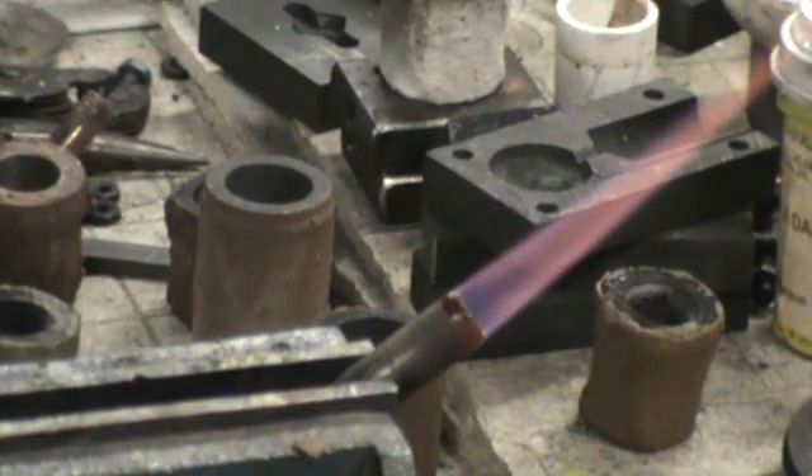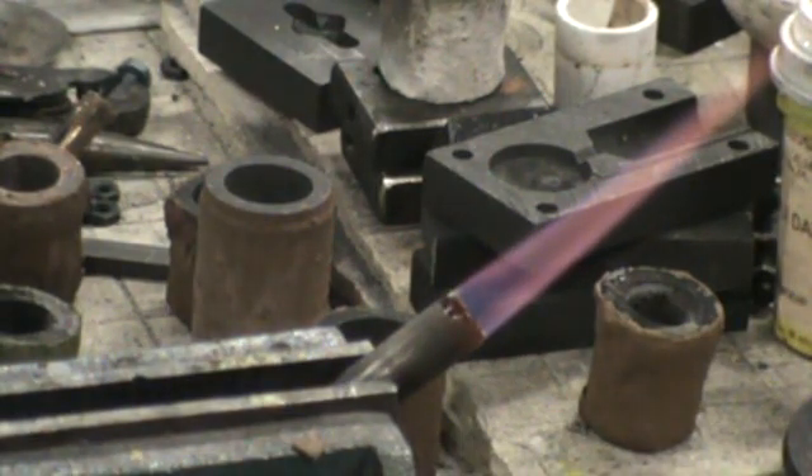Possibly it takes maybe 10% longer — the thicker you get it, the longer it's gonna take to melt. But anyway, that's just a mixture of ceramic coatings. It's probably about 10% of the ITC 100HT, and then the other one I used was the ITC 215. It's a ceramic coating for metal parts inside of kilns and furnaces. At the cost of graphite, this is a pretty good little venture. Anyway, that's just a tip on how to get more life out of your graphite.